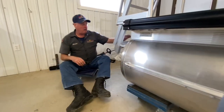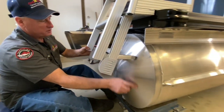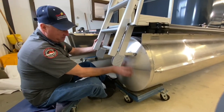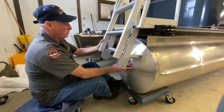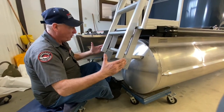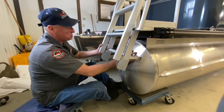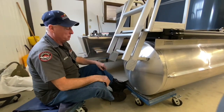If you come back around here, you can see how they do the construction of this. You can see the ridges — this is what they call a spun cap, where they form it on a die. It's formed perfectly every single time by rollers, which gives it this spiral look. That actually gives it structural strength rather than a smooth stamped piece — which is incredible.